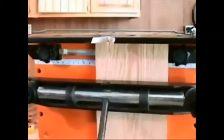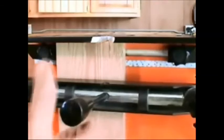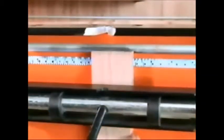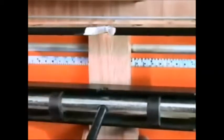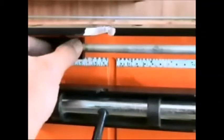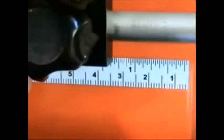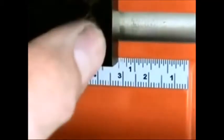You may locate material on the N-Lock a variety of ways: by using the center line of the N-Lock table, or by using the N-Lock stop system. The stops provide accurate, repeatable, and easy right and left alignment of your work. You can center material on the N-Lock Jig by simply using the left and right rulers built into the face. The rulers also provide a means by which to set the stops, indicating the precise distance from the center of the dovetail socket.